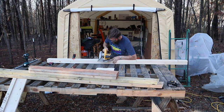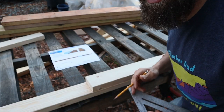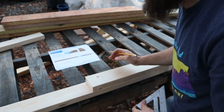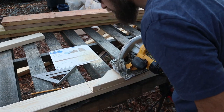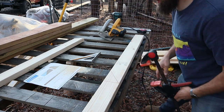First cut, nothing fancy. The second cut is a different story — it's a 55.6-degree miter. But because I drew this out beforehand and it's in my build plans, I know exactly what I need to come over from this corner to get that cut. Same thing on the other end, and I'll make these two cuts. Beautiful. My next piece is already marked. The frame is now completely cut out, and it took me about 45 minutes with a little sidetrack helping the girls.